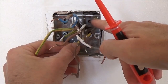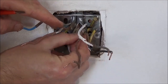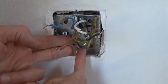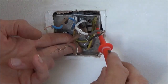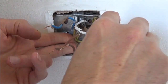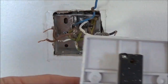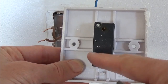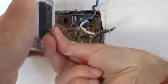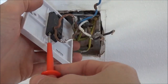But in this example inside your metal back box you should have an earth terminal. Take both of your earth cables, push these to the back of the back box out of the way — that gives us a little bit more room to work on the rest of the wires — and do that up nice and tight. Get your live wires from both cables and put those into the L1 on this switch. Once you're happy that those are in with no bare cable exposed, tighten up the screw.